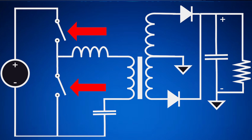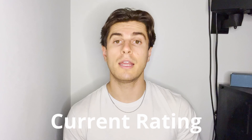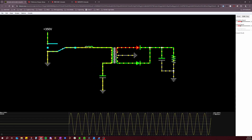The purpose of these two MOSFETs is to control the behavior of the resonant circuit. When the high-side MOSFET is on, the resonant circuit is connected to the input voltage source, and when the low-side MOSFET is on, the resonant circuit is connected to ground. When selecting MOSFETs, you'll want to be familiar with the drain-to-source voltage rating, current rating, and power dissipation rating. One important thing to note is that the LLC Half-Bridge operates in zero-volt switching mode, meaning that when the MOSFETs are switching, there is zero volts across them, so there are no switching losses.